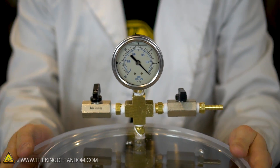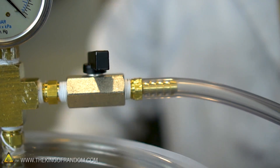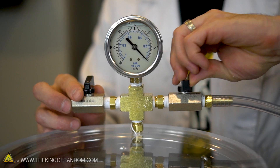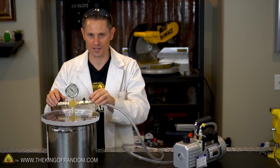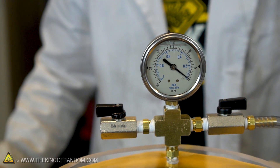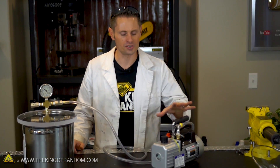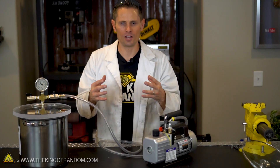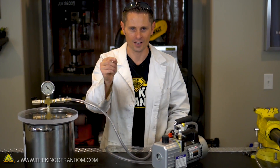Here's the idea of how this works: we've got our pot with the lid, and when it's closed the vacuum pump will suck air out of the system. We've got these little ball valves so we can close off the vacuum, turn the pump off, and it should hold pressure. The other valve on the end lets air back in to repressurize the system. And of course this is optional, but I added a vacuum gauge just to see what pressures we're drawing. You're probably thinking that air is going to leak under the bottom of the acrylic — you are exactly right. We need some kind of rubber gasket to seal the cracks, and for that I'm using proto putty.